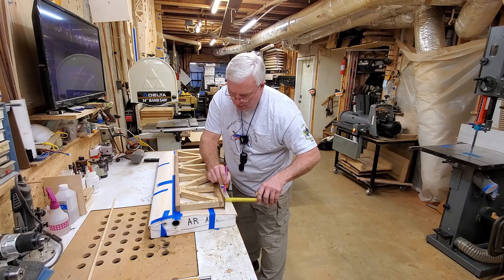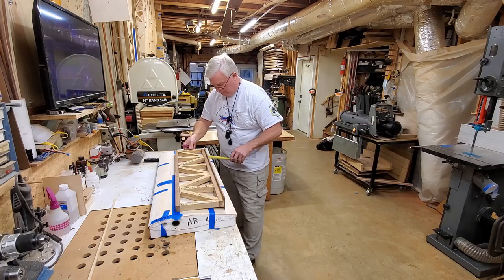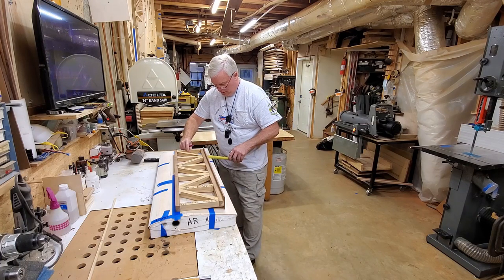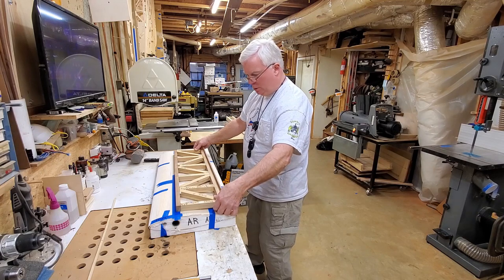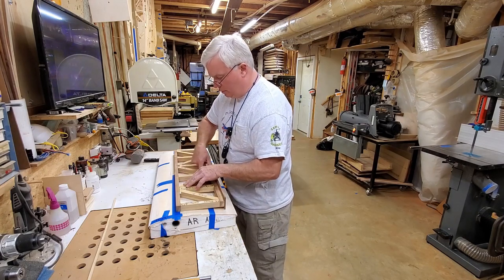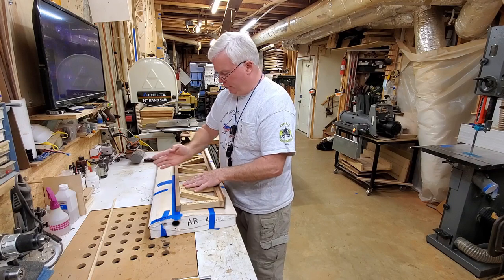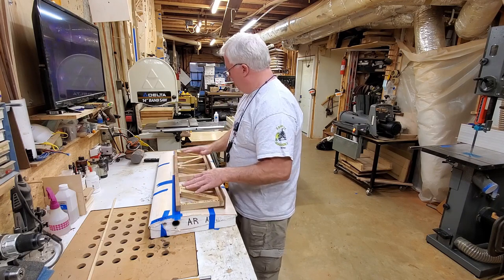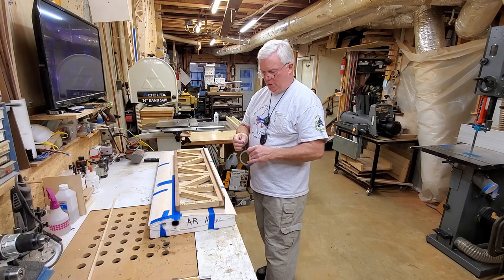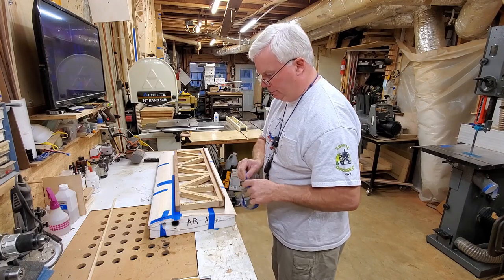So I'll take the pencil, and I'm lined up good there. I'm at an inch and a half. Put me a line there, get an inch and a half off of this seam. And there, so that should do it. So triple check, no blue tape here, so we're not gonna hit the wing tube socket. We're lined up just right on our false rib to come right down the center of that. And we've got an inch leeway in there, so that's not that critical. That looks good, so let's take a couple of pieces of tape and just tack it down, keep it from shifting on us.